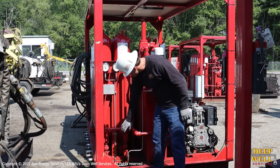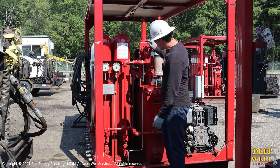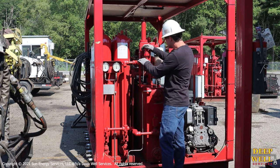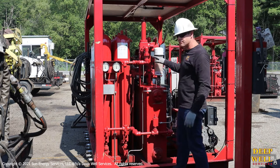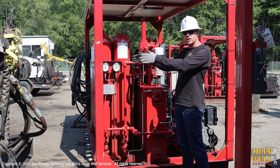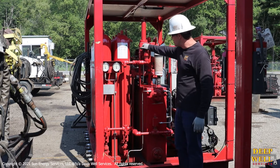The fluid is in the bottles, but this line tees up here as well. This is the line that brings the pressurized fluid from the bottles up into the manifold, where the fluid actually gets directed through the handles out to the actual BOPs that are being run.